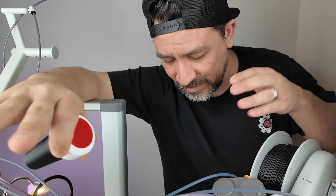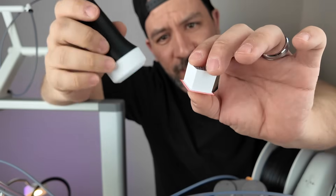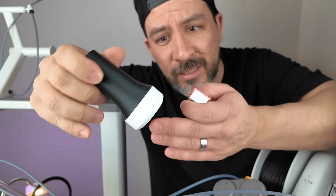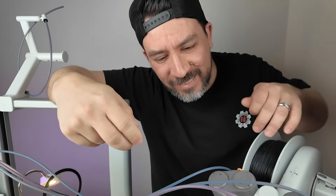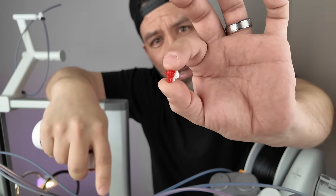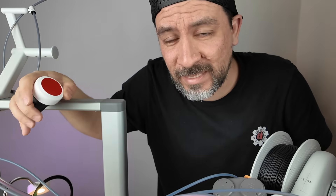There is one slight downside: you're going to have what's called a purge tower. This ensures that as the filament is being laid into each line, you don't get bleed-through from, say, red to white. You'll also have what's called a filament poop — as the system removes one filament color and feeds the next, it purges a certain amount to complete the color change. If you'd like us to make more content around car parts using advanced filaments, let us know in the comments. If you're interested in scanning and making your own parts, watch the next video.